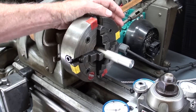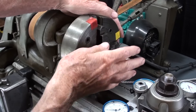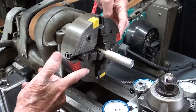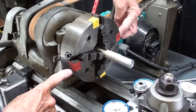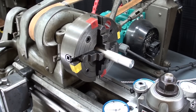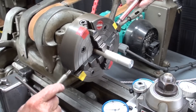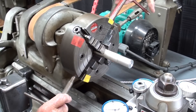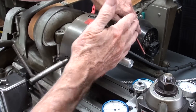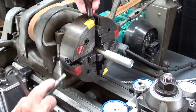This is a nine-inch South Bend lathe with a four-jaw chuck, and I already have the work in there just rough. I put tape on the chuck so that the two reds — you can concentrate on working in this direction — and then you've got the two yellows this way. Many of you do not have two chuck keys in the right size, but the whole gist of this is to set your keys opposite one another, and with the indicator in place, move the jaws and the work back and forth until you zero it out.